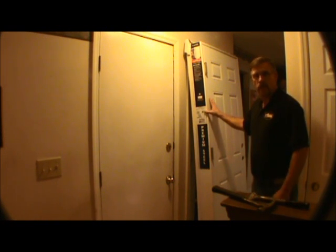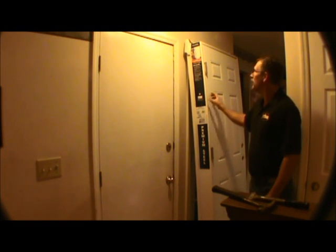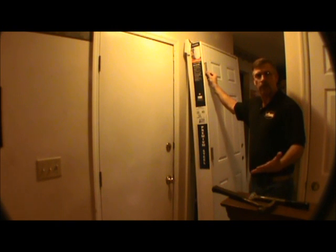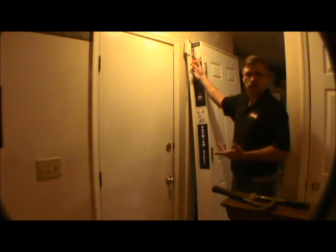One of the quicker ways that you can tell if a door is fire rated or not, not always guaranteed, but a good indicator, is that the hinges will be spring loaded so it's self-closing, so the door always remains shut no matter what. Also, when you buy them, it'll say fire rating.